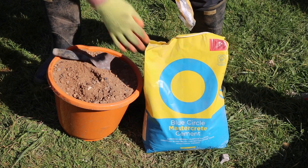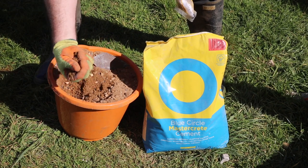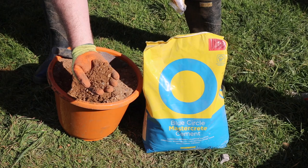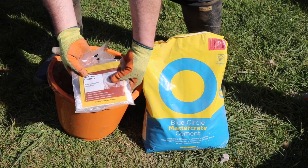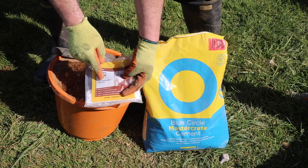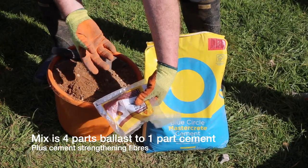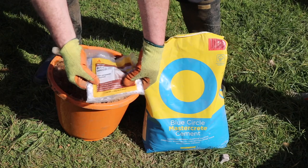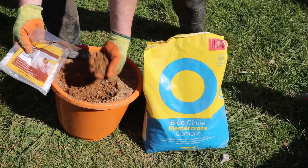To make your concrete you need cement — this is ordinary Portland cement. You need ballast, which is a mix of sharp sand and aggregate; a small aggregate of about 6–9mm is what you need. In addition to that you should add some strengthening fibres, which are available at your DIY store. The fibre admix also acts as a plasticiser and helps to waterproof the concrete, which is ideal for what we want. You want quite a stiff mix — not a sloppy, porridge-y mix — it should form and stay in a ball in your hand.